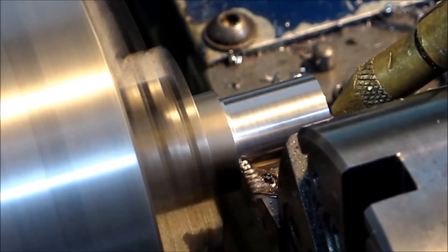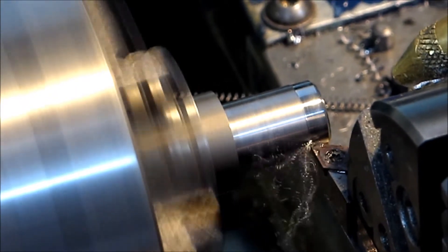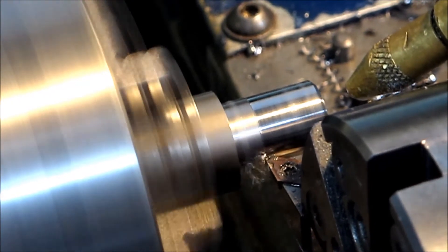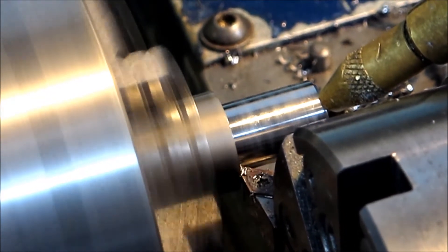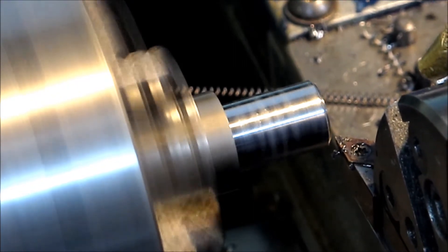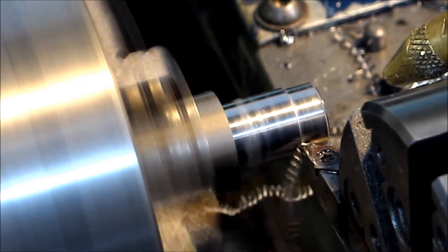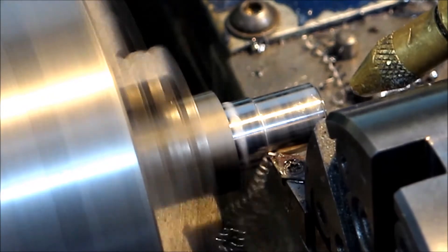Your roughing insert has removed the bulk of the material, so the finishing insert doesn't have the wear that the roughing insert will have. The roughing insert is usually a molded insert rather than a ground insert so that it can really remove metal quickly. But if you've only got half a horsepower to play with, that's not terribly relevant because they're difficult to use. This finishing insert has 15 degrees of rake, a ground sharp edge, and it really hoses into the material nicely. A molded insert usually has about six degrees of rake, and a molded edge is nowhere near as sharp as a ground edge, so your machine has to work a lot harder.